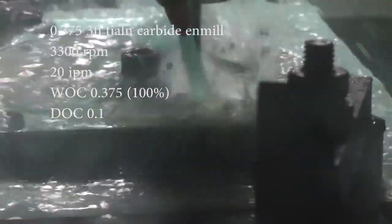This is just cutting out the center hole in the mount, so the I think it's a 2 or 2.5 inch pulley, I can't remember the diameter, can fit through. I clamped the main body of the mount and I bolted that centerpiece in there so we don't have anything flying off and breaking my only aluminum cutting end mill that I have.